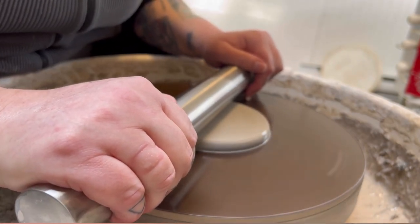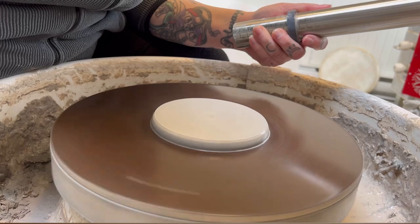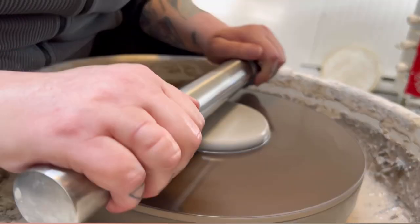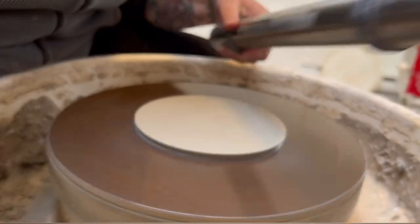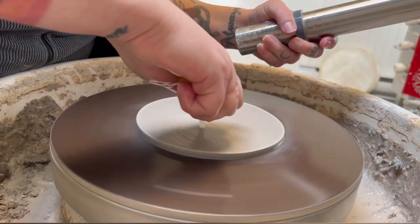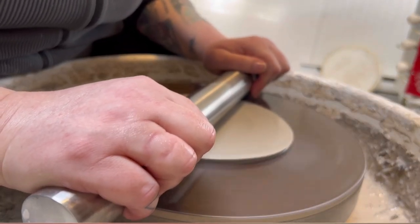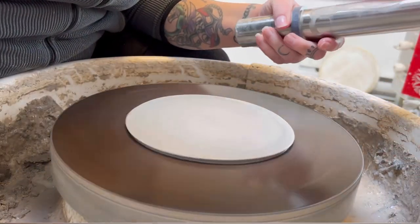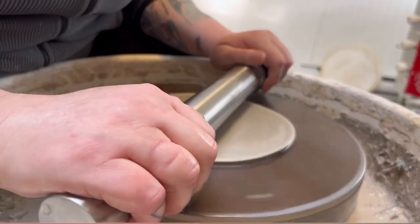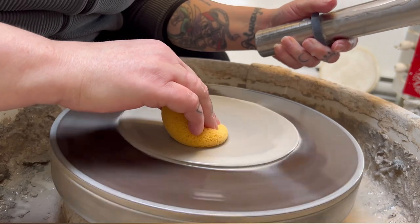So you just press until you start to feel a bit of resistance. This is quite dry now, so water is key — just keep going. You can feel the resistance; it starts to kind of pull away from you. If you continue pushing down without rewetting, it will cause it to jump like that. So if that happens, what I do is slow it down and press hard — that usually corrects the issue.